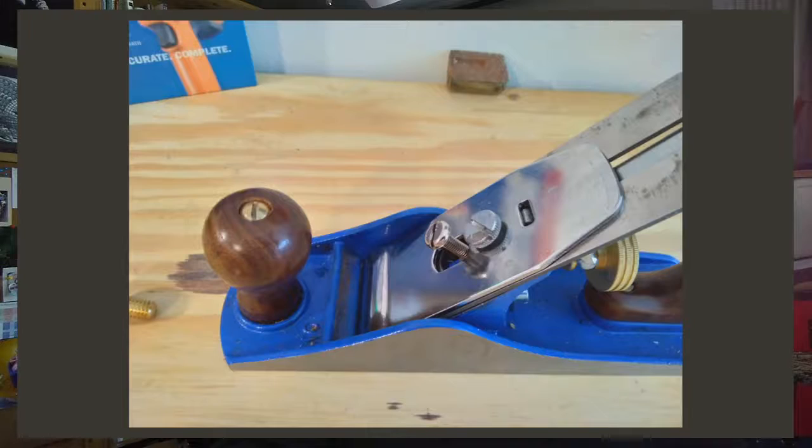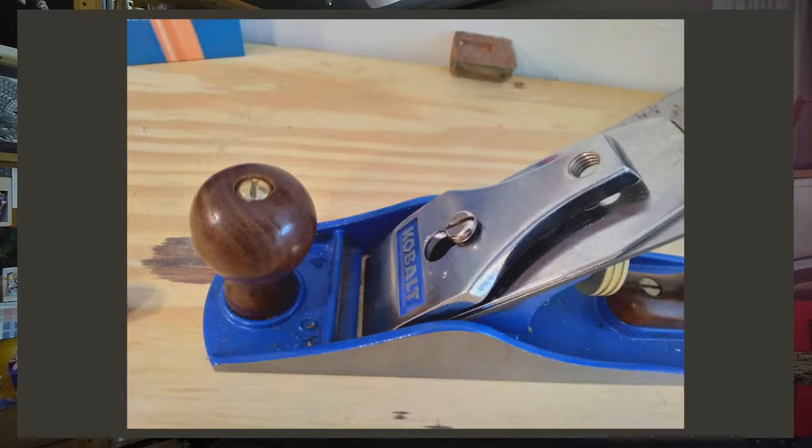One thing my dad taught me was never to force an assembly together. And now it's mostly worked out. Blade on the bottom, then the springy steel bit, then the heavy top bit. I've already very carefully threaded the set screw into the springy bit, and now the bolt is in place as well. Note how the heavy top plate drops down over the bolt, then slides up so the bolt's head binds on the edges of the slot.